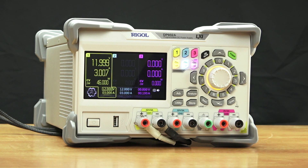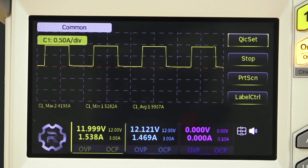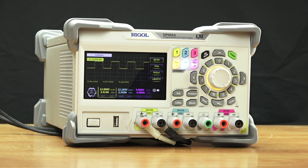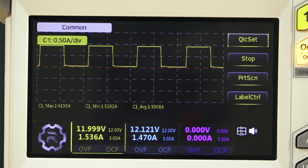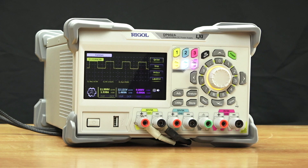We've also made a couple of changes to increase both the speed and accuracy of this instrument. We can go into analysis mode and we can see the square wave form factor here that we're producing in current space. We're actually pulsing between 3 amps and 4.7 amps, and you can see that's changing every few seconds in a pulse formation — in response to the device it's connected to.